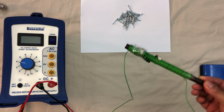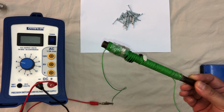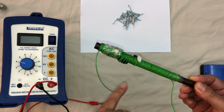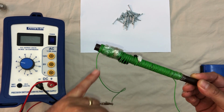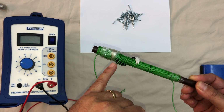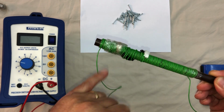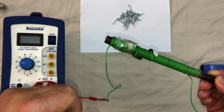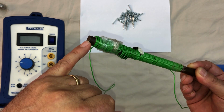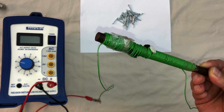Now, one I showed you last lesson was this one here. If you remember, I showed you how to make an electromagnet. It's as simple as this. You get a long piece of insulated wire, it has to be insulated. Now I've actually twisted together several shorter lengths of wire to get one long one. That's what these little bits of tape are here. This is just the connections. And then you wrap it round. Now in this case I've got a soft iron core. Has to be soft iron because soft iron can be magnetised and demagnetised at the flick of a switch.